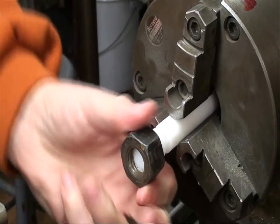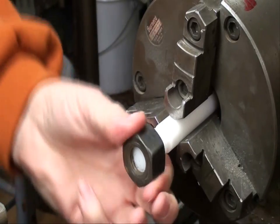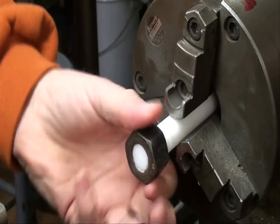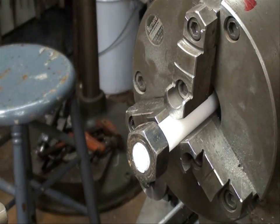The nut's going on just a hair tight — it actually should have another very light pass. But there we have it in four passes. Let's review what we did: the lathe was set up the same as in the last video, with the exception of the tool being upside down but still set on center, and we were turning the lathe spindle in reverse. Everything else is the same.